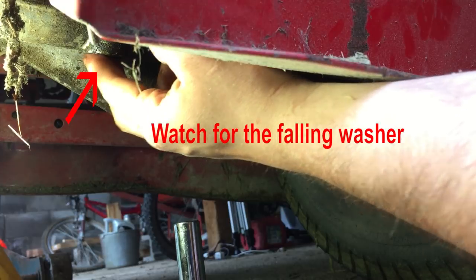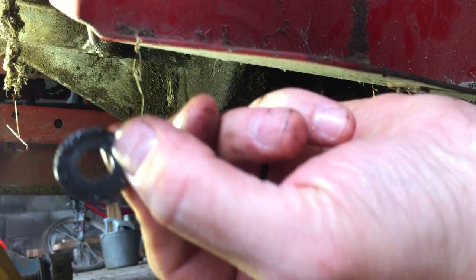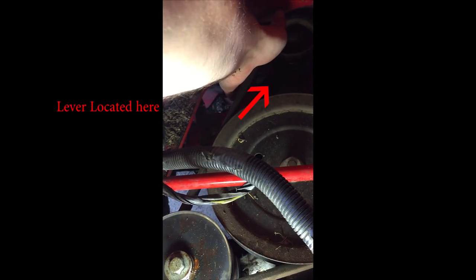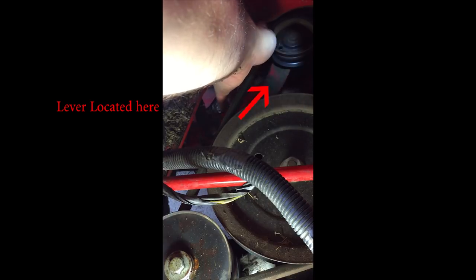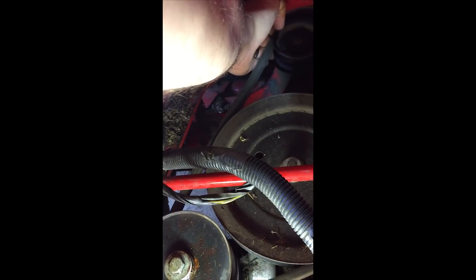We're going to remove that too — don't lose this piece. In order to remove this pulley, we need to release tension on the transmission belt, which is the upper belt in this system. Up in here there's a lever that swings this pulley into place. We're going to remove the drive belt from this pulley by pushing in on this tension lever. I was able to push in and then lift the drive belt just over the pulley, and you heard it snap into place.